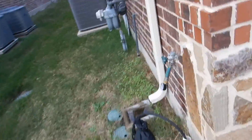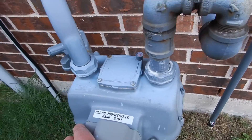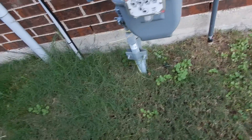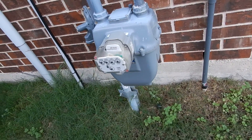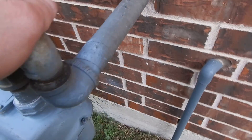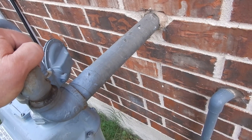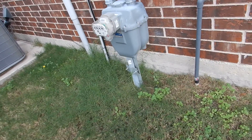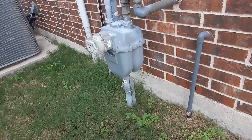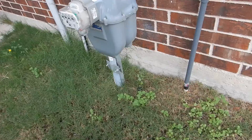This home — on the south side of the garage — has gas plumbing. I'm not finding, I cannot determine that we have electrical bonding. There's a little electrical bonding on the furnace, but I don't think that's enough. I will mention the bonding on the furnace, but I'm just not seeing it elsewhere — it might be somewhere, but I don't notice it.